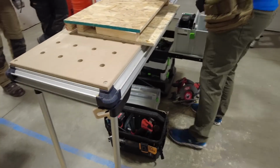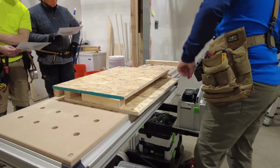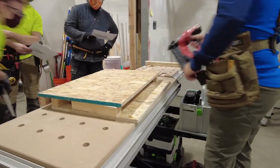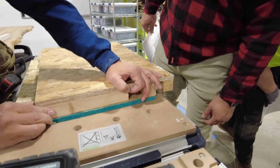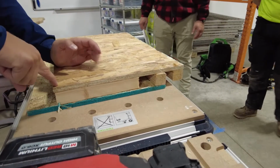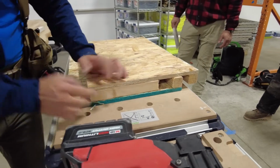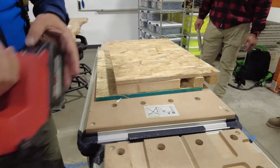So your cut person, don't worry about lining this whole thing up. See how that's in? Come over here and look at that quick. See how that's way far in? I could spend a very long time getting this just perfect, all the way like this, right? Perfect, perfect, and slip. Again, you've got gloves on, you've got glasses on, it's cold, it's windy, it's raining. I'm going to put one nail there. I only care about this. Make sure it's not overhanging and it's not too tall. It's the only thing you have to worry about.